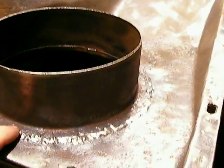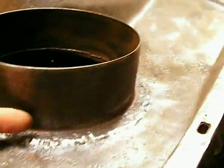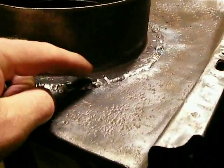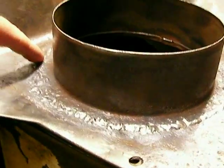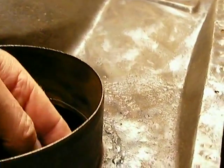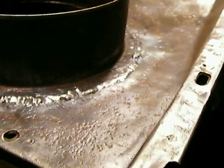Here's the main issue right here. These air intakes — these round deals — they're sheet metal, and they have a 90 degree bend that comes out at the bottom, and there's a half inch lip down here. What they do is these are spot welded on, and there is some form of pretty weak sealer in there. You can see there's a lip inside, and you can see remnants — if you look right down in there, you can see remnants of some foam. I guess that was originally a water seal, but it's very under par.